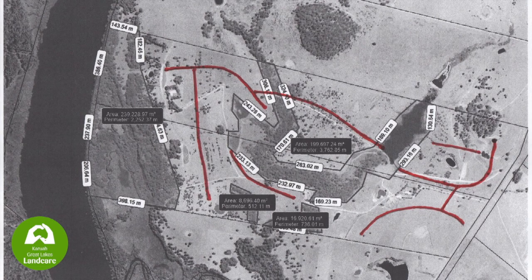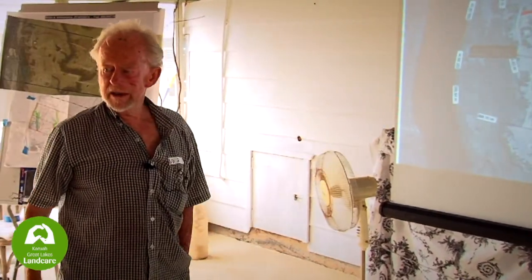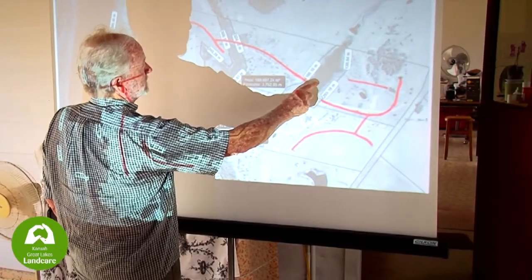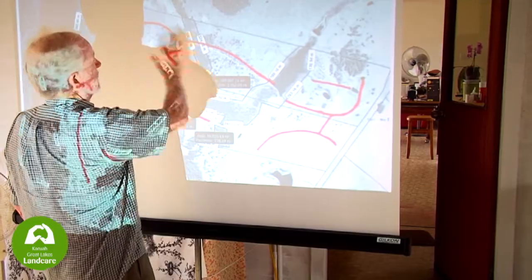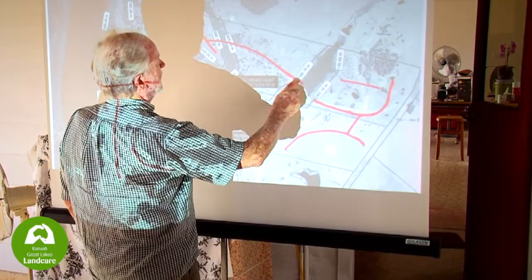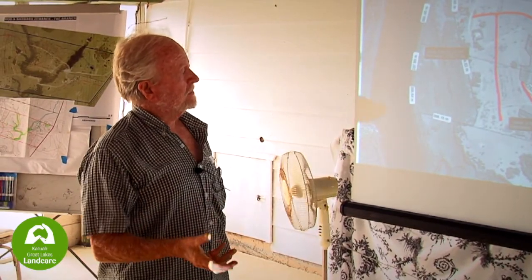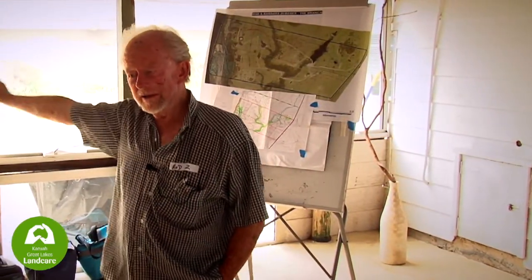This is what we're planning to do here. We've put in an application to LLS to fence off the riparian areas to keep cattle out and keep the streams healthy. From here, we're planning to put a fairly large solar pump — 10 cubic metres an hour — and pump water from the big dam up to the turkey's nest dam which is 30 metres above the ground. That pressurises the pipe all the way through — all that red line is pressurised to 30 metres. We dug a dam up there; it's a bit leaky and the walls are green because the water's leaking through and the grass stays green. Water going through the soil is what we need.